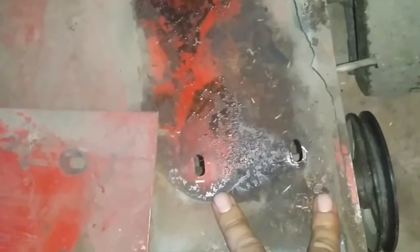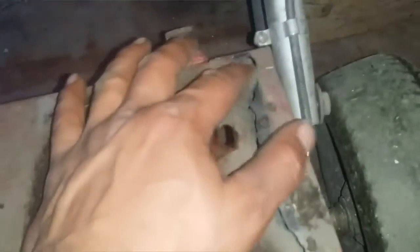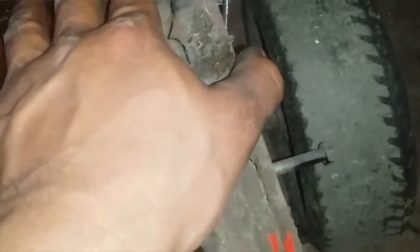So I already pulled the motor. Not much to it. You unhook the belt and these 4 bolts keep the engine secured to the body. And there's this stabilizer plate that sits right there. I didn't really know the extent of the body damage until I removed the plate, because I thought it was just cracking a little here and then shaking apart a bit. Luckily, it's bad, but it's not unsalvageable, you know what I mean?